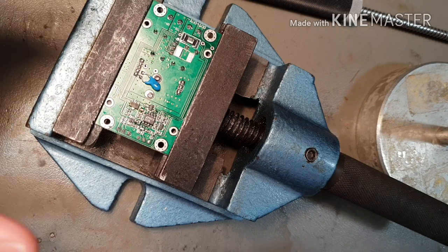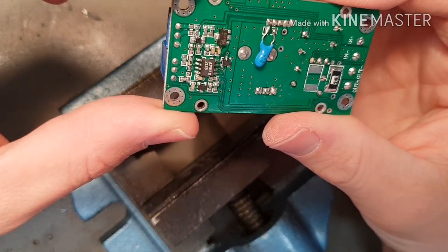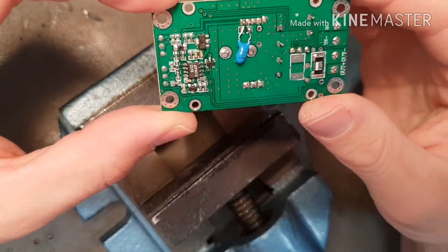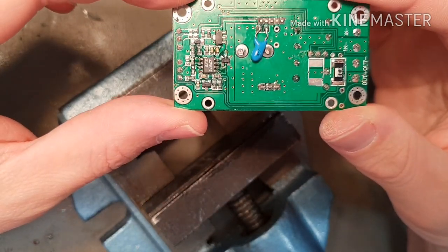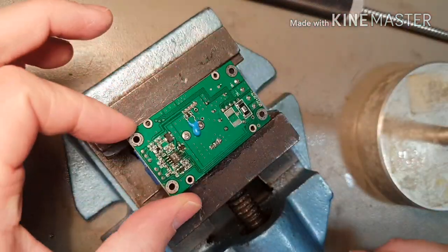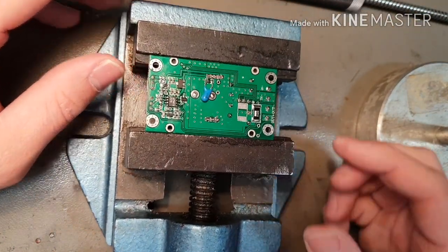It really shines in tightly controlled processes where you can lock down which tip was in use at which time, because the temperature is intrinsic in the tip, but unfortunately for this kind of work, they're not ideal, in my opinion. And this is a prototyping shop, so there's no reason to have a Metcal other than just the engineer who bought it happened to like them.